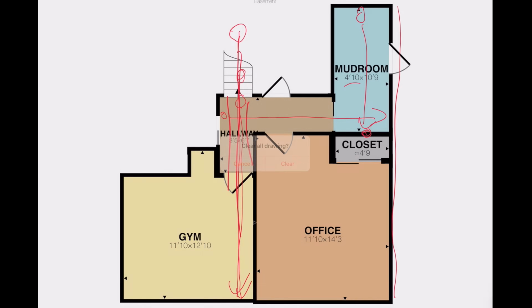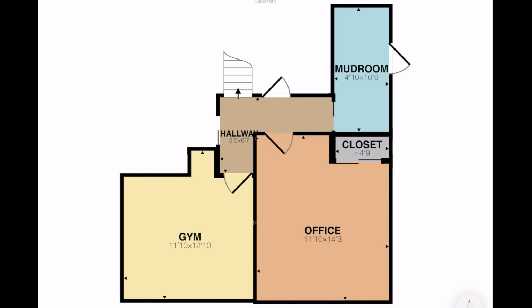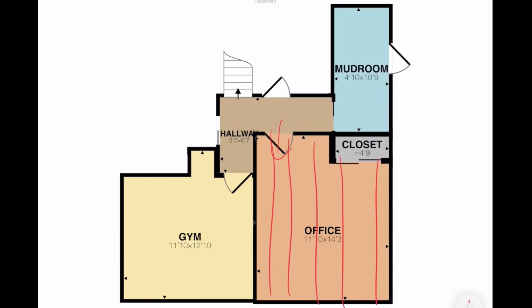So a couple other things to consider is the point of entry into the room, the floor, or the home. So if we're only doing one room in this case, and you were to walk through this door, the point of entry, to have them parallel, the boards would be going this way. If you're doing the main floor of your home, when you walk through your door, if you have line of sight all the way to the back wall and you have like a hallway there, a lot of times people will recommend laying the boards down that way.